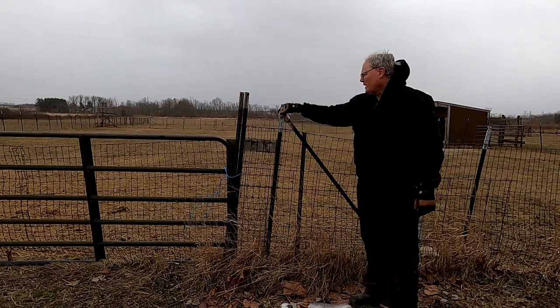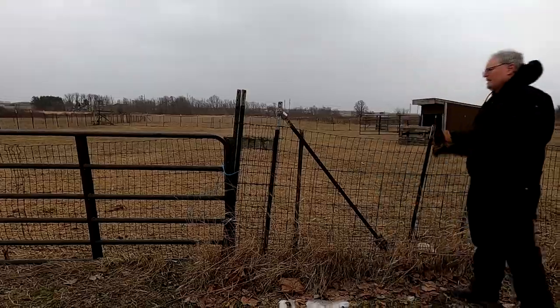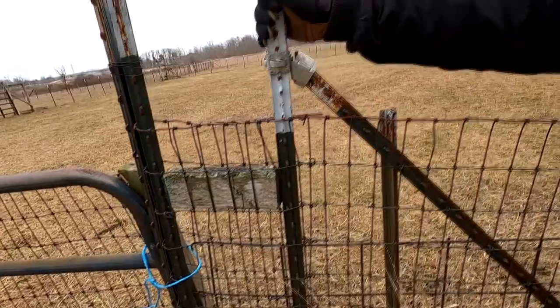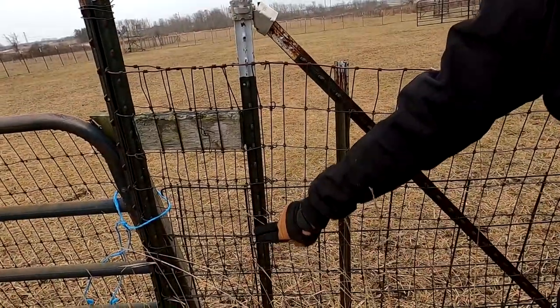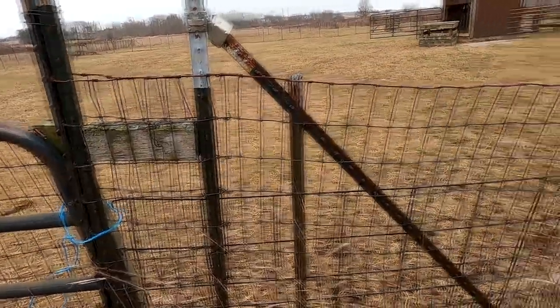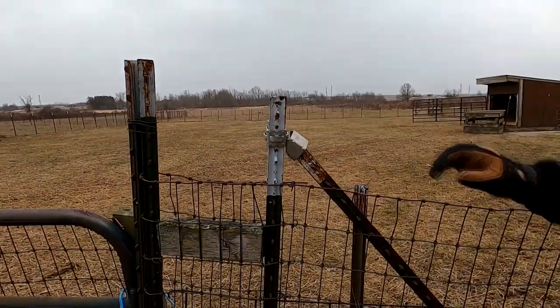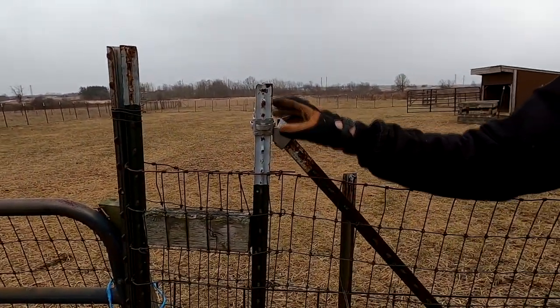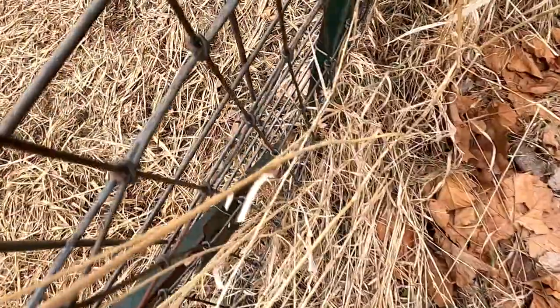So you have to have one set up here and then one set at the bottom, and that keeps the post when you're stretching it. Like I said, it pulls and it holds the post in place, and then all the pressure's down here and it's going to bend there. If you do it right, it won't bend a lot. You don't want it to bend too much and break it, or you don't want so much pressure it actually bends the aluminum, because these are just soft aluminum sleeves. So it's more of an art than a science, I guess.